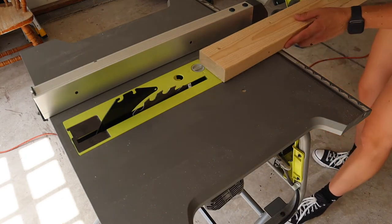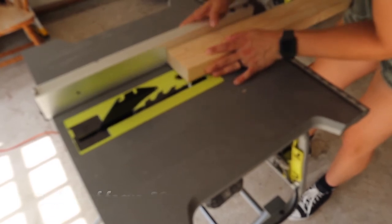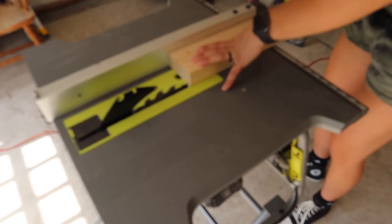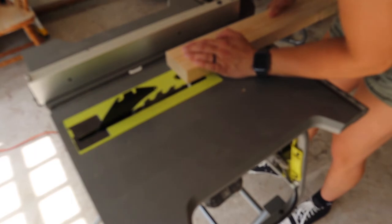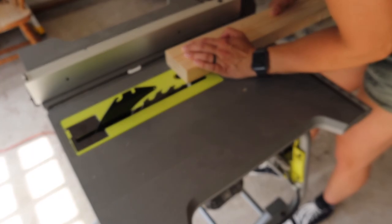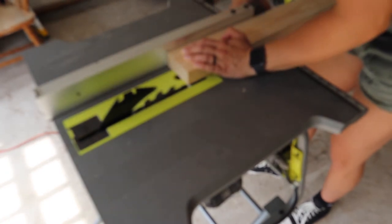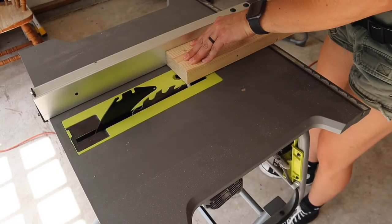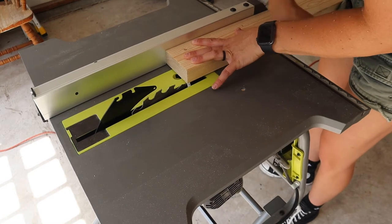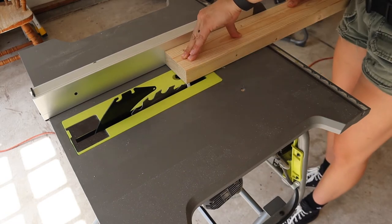So I have my 2x4. I'm going to hold the fence and the 2x4 and kind of squeeze it over to get an idea of how much I need to take off. That's way too much — we're going to scoot her back. I would say probably about a blade's worth. It's a little over a blade so I'm going to scoot it back over to the right — right about there. I'd say that's about one blade's worth taking off.